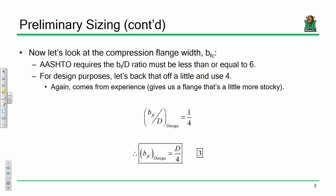It's the same. I mean, what do you mean? Are you talking about the actual size of the stiffener? The actual size and the thickness of the stiffener isn't really that difficult. There's some very fundamental equations, like, you know, you have thickness limits and width limits. You can solve for what the size of the stiffener needs to be relatively easily. That's not really the challenge. The challenge is where to put them.